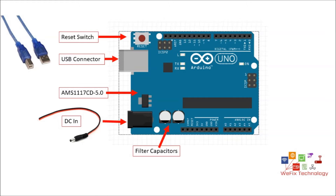The DC range is 7 to 12 volt as mentioned earlier. Since the Arduino microcontroller works on 5 volt, there is a voltage regulator — AMS1117 5.0 — that downregulates the input voltage to 5 volt. The recommended DC input voltage is 9 volt to power up the Arduino. There are also filter capacitors used to make the DC voltage ripple-free.